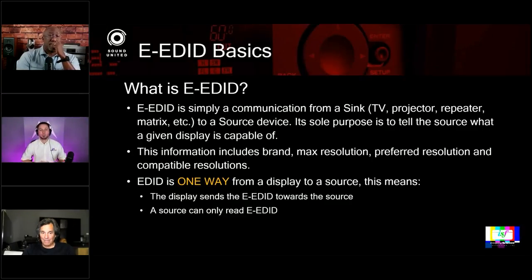And sometimes, Jason, in the early days, did you have to turn the HDR request on the TVs on manually? Oh yeah. It was like that until last year, maybe the year before. If you didn't go into the HDMI input menu and hit a button or flip a switch, then the EDID never asked for all the good stuff. Were the manufacturers crazy, or did they know something, like maybe there's no HDR sources? It's funny, because at first, like day one, we're like, this is weird. But day one plus 1 hour, we go, wait a second, this is smart.